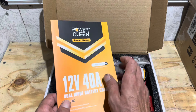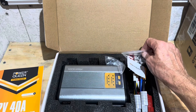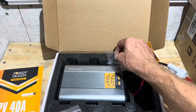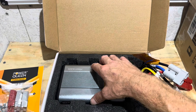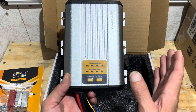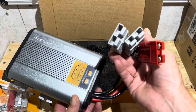Let me show you what you get with this unit. You get a nice comprehensive user manual showing wiring diagrams, where everything hooks up, how to hook it up, different specifications, limits on voltages and currents. It comes with extra Anderson SB50 connectors, because this unit uses Anderson SB50 connections — very nice heavy-duty connectors. It comes with mounting hardware to mount it to a wall, your RV, or your 12-volt power systems. Very ready to use out of the box. Just make up some wires, put some circuit protection on there, and you're good to go. It also features multi-chemistry with reverse charging.